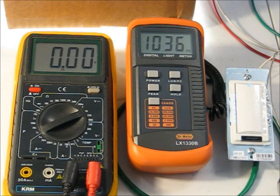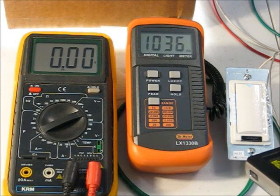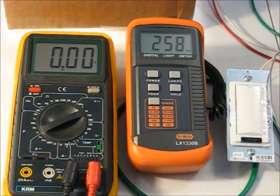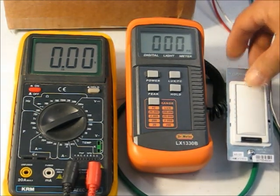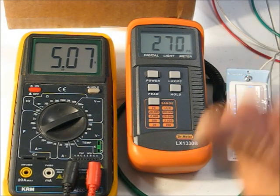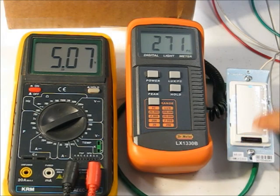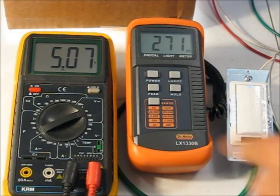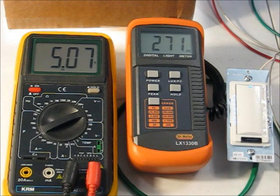This will tell me, basically, as far as I'm concerned, that whatever I put in as a percentage is going to directly relate to the control voltage out. So let's take her down and take it back up and get a look at the control voltage, and it's 5. So for a 50% setting on the top end, we've got 5 volts. We can assume that we can relate the percentage to our control voltage.